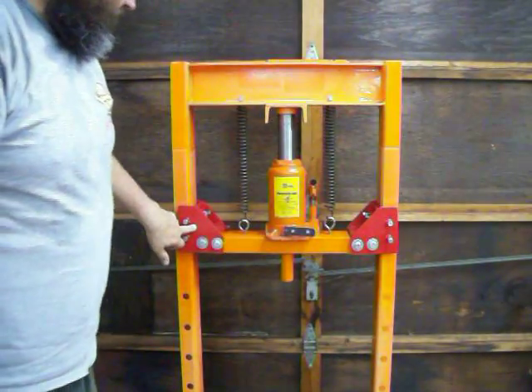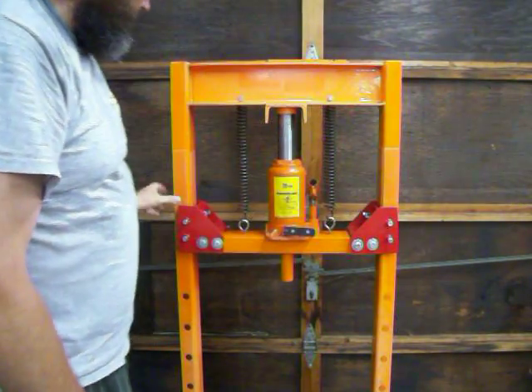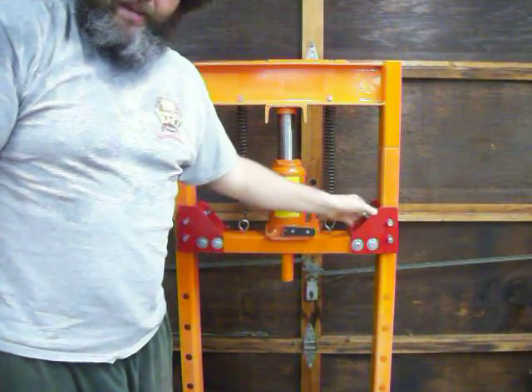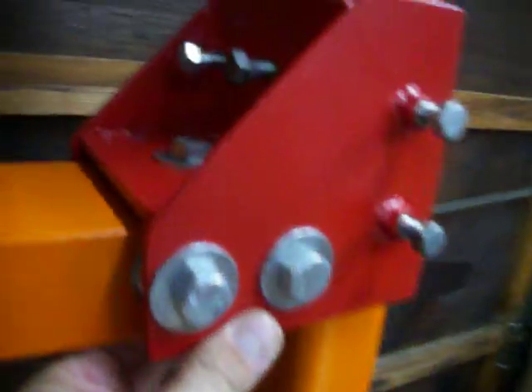And then what we ended up with are these brackets, which basically have gibs on each side. So there's three gibs per leg of the press. There's a little gib plate back here, and that's nothing more than 3/16 steel with some 3/8 gas pipe rings cut out and welded to the back of that, so the screws hold the gibs in place and keep them from falling through. And then to make up the difference between the ram and the bracket, those are just washers — some more washers under there, and washers back in here as well.